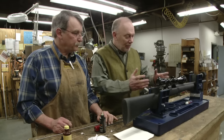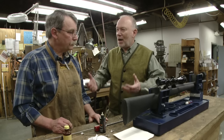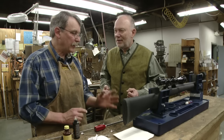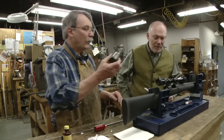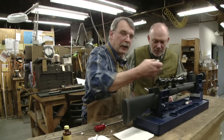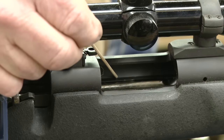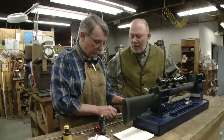Speaking of lubrication — now that the barrel is clean — lubrication is something that is probably overdone today. Too many people use aerosols, which are directly sprayed into the trigger group, into the action, and it runs everywhere. You're better off with a single drop of oil. You would put it on the rail on both sides. That rail is really where the bolt rides, and that's the friction point — that's why you want a little lubrication there. Where these bolt guides are riding, they're protected and smoother. But that really is about it.